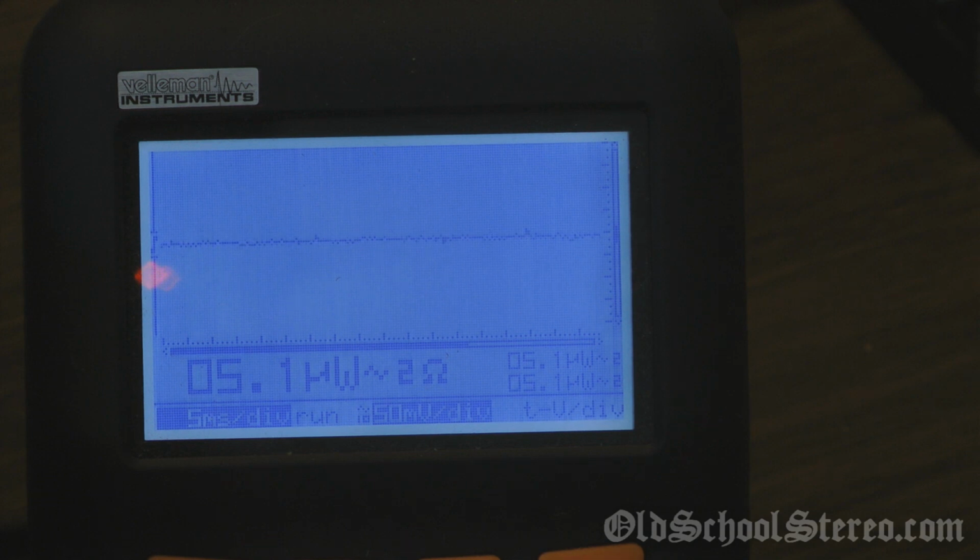Okay, and the final test for the Orion 275SX is the 2 ohm mono test. Let's see what it'll do. Now, noted, it is not rated to handle 2 ohms mono, which is a 1 ohm stereo load per channel. But we'll be careful with it, and let's try it out and see what she'll do. That's clipping hard. 380.8, it looks good. So we'll go with that. 380.8.